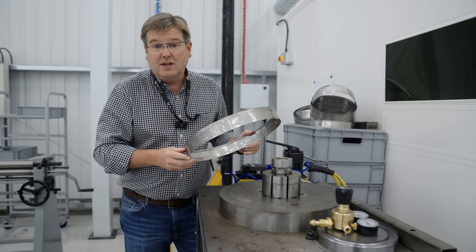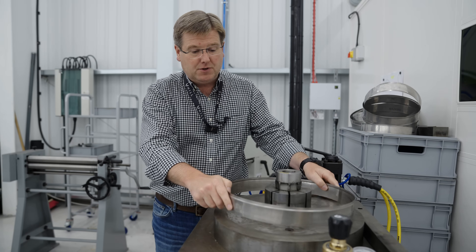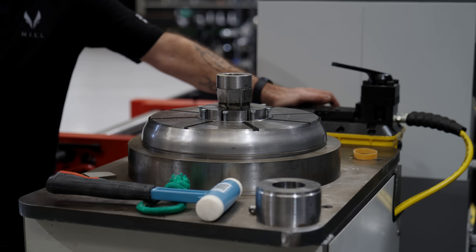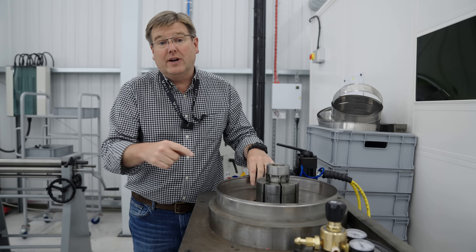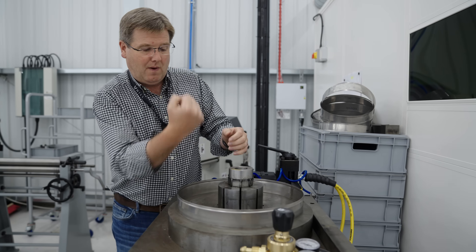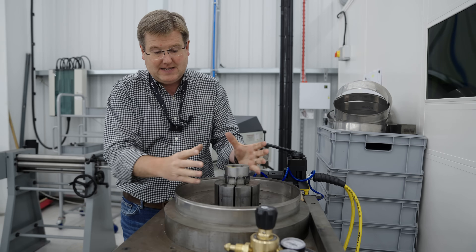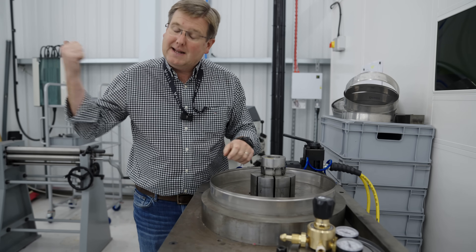With the new high quality rings form rolled with the profiles in, the next stage is for them to go on to the expander and to be stretched out to be perfectly round and to the correct size. We're currently building a whole suite of new pie slice tools so that when we pull the tapered pin down and expand these out, each and every one of them fits perfectly. Let's go and have a look at those.